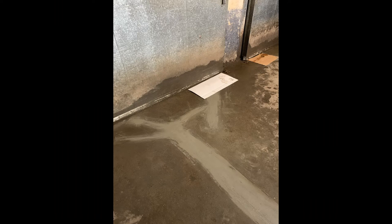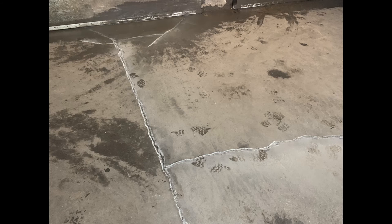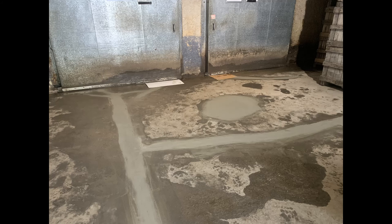Here's another section of the floor — you can see cracks, but there's also a pitted section in the upper right-hand corner of this view. In the next view, you'll see we chiseled it out and were able to fill it. That's a good example where a mag float or a larger float was helpful in smoothing it out.